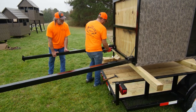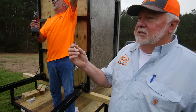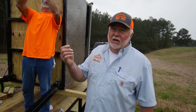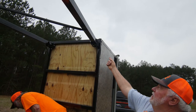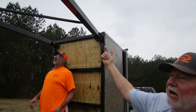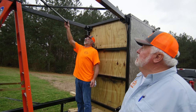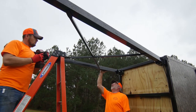Finish installing the rest of your legs. The next step is to attach the cross braces using self-drilling screws. We use screws instead of bolts because out here on unlevel ground the bolt holes never match up. When screwing the cross braces on, just split the difference — same distance down here at the bottom of the leg on the opposite side. It doesn't matter if the braces are on the inside or outside, but always go over one brace and under the other — this puts a slight bow in them so they won't rattle in the wind.